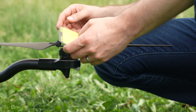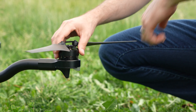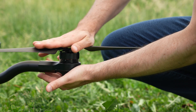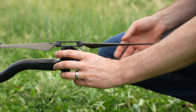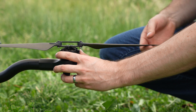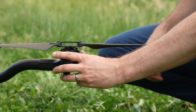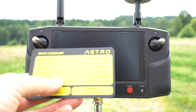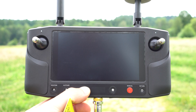You can remove the protectors and unfold the props. Props and motors: check for free rotation — just spin the motor and make sure that it spins nicely. You can apply a little downward force, upward force, and check that the bearings feel good. The propeller blades should spin smoothly and freely and there shouldn't be any vertical play. No payload on this flight, so let's go power up the controller.